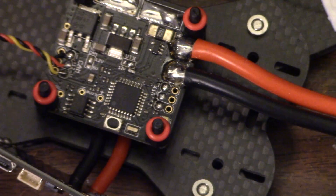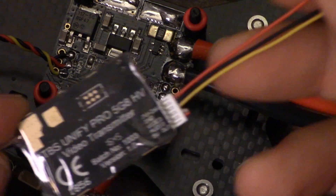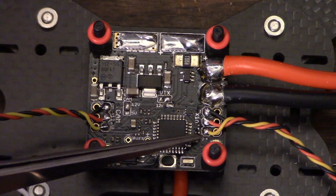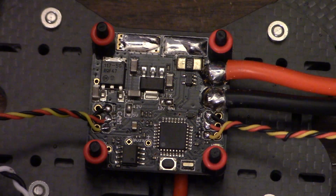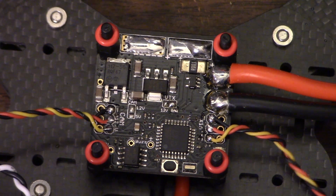Yellow is the video. I'm not running audio, so I'm going to remove the wires I'm not using. I'll do the old strip and solder. So I've got the camera header wired up and the video transmitter header wired up, and I've got the VTX wired via the solder bridge to take raw battery input because the video transmitter can handle up to about 24 volts. I'm also going to use my heat gun to twist these wires and encourage them to keep the twist, just to keep things neat.